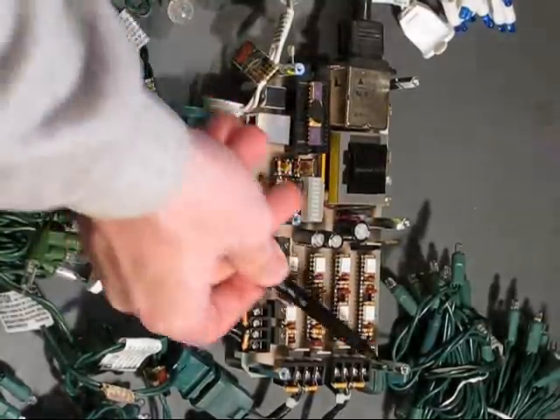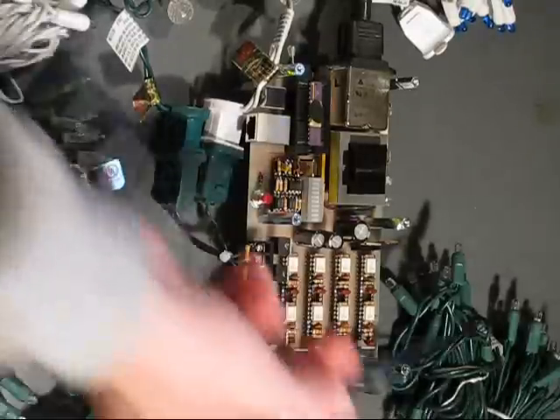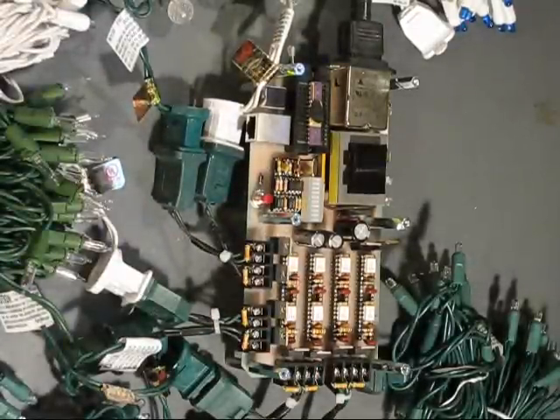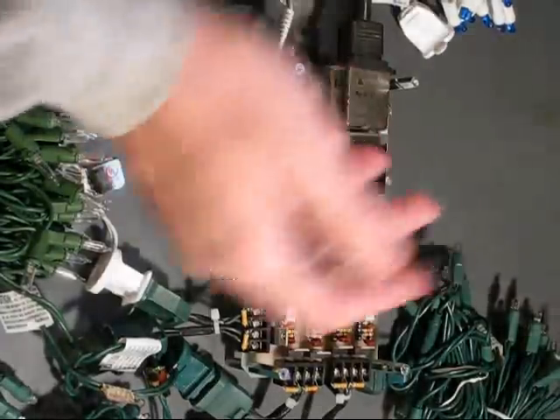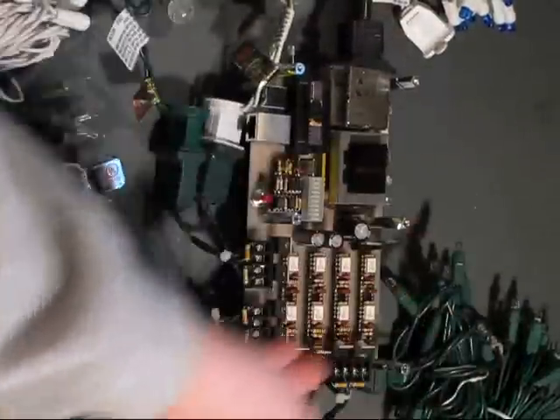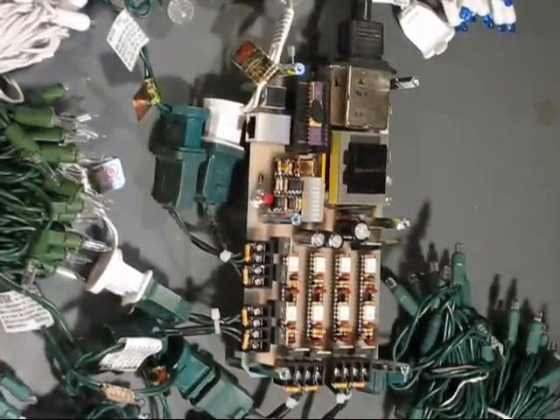There are 8 physical channels, but for LED lights there's the ability to control half of the LED string separately from the other half. That's based on how they're manufactured — there are two competing directions of LEDs, and by controlling the positive and negative voltage you can control those separately. So I have a set of LED lights and some older traditional lights that can be controlled as a single channel.